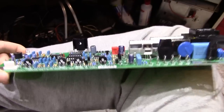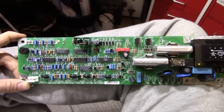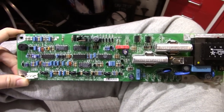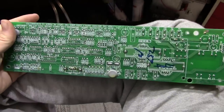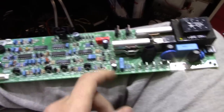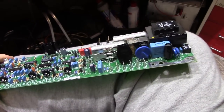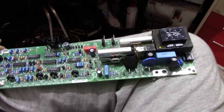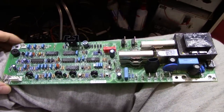These are pretty much the simplest and most open units you can find — they don't have any black magic going on whatsoever. If you're able to trace this circuit out, you've got access to how the entire unit works and you can do whatever you want with it. They also have a very distinct lack of electrolytic capacitors in general — this one's got just 4 in total — and they have all the prerequisites for being very hackable, very reliable units.